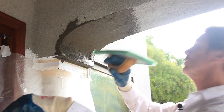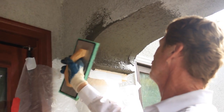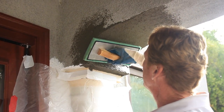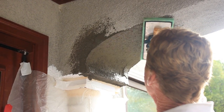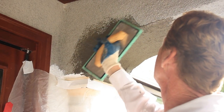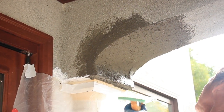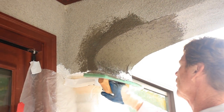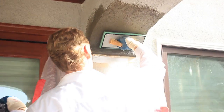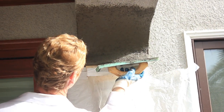Green sponge float — a lot of water on it to feather this in, and I want to bring the aggregate out here on the corner. I want to take it up because I want it to strengthen. If I just take it down it'll fall right out, so I come up here. Got to get this corner because there's no wire reinforcing it — it's just a hand corner. We're doing it by eye basically, so we get it as best we can. Take that arc here, clean this up down here, pull it inward — if I pull it out I'll lose this corner. So we pull it inward and reinforce this with a lot of water which strengthens it. Come around here and same applies on this side — upward motions. Everything is upward, otherwise we lose these handmade corners.